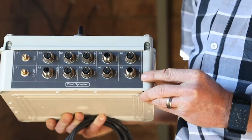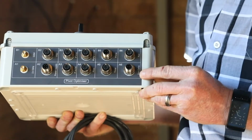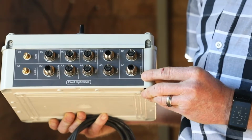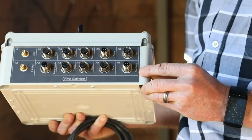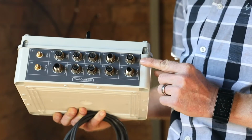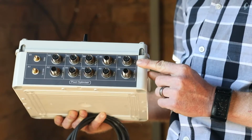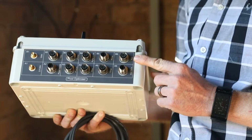This port here is for a star delta connector. This is if you're using a suction pump which is installed in a river or in a dam and lifts water up to the main pump. This connection will allow that external pump to be started and stopped remotely from this unit. The last connection is the auxiliary port. This is used for selecting pivot A, B or C in the case of operating in mode 0 or mode 1.